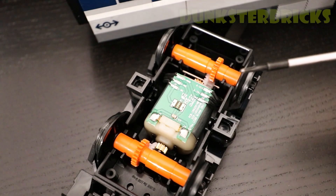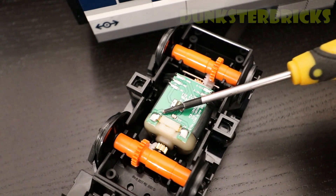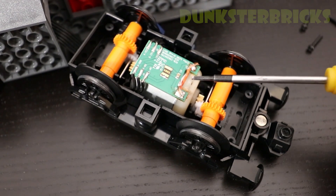So how do we reverse the motor? In the casing there is a circuit board that is soldered directly onto the motor. We need to find a way to connect the pins on the motor to the opposite side of the circuit board. You can't just flip the circuit board over because there's no way to solder it onto the motor, and you wouldn't have the space to fit it back in the casing. You can't just turn the motor around either because the casing doesn't allow that. So the solution I came up with is to run wires from the opposite pins of the motor and cross them over onto the circuit board.